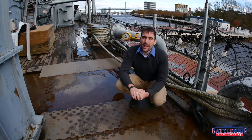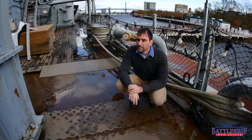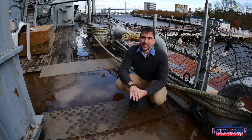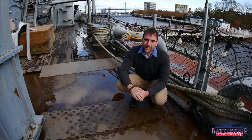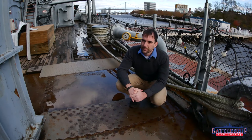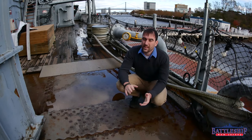Unlike the Liberty ships, which are designed to be mass-producible — they're blocky, they can be built in segments and thrown together really easily, which involves a lot of welding and deleting the riveting entirely — Iowa-class battleships are not built to be prefabbable. As a capital ship, the U.S. Navy chose to expend a lot of resources building unique pieces that would have to be basically hand-pieced together at the Navy yards. That's probably part of the reason why two of the six Iowa-class battleships were never completed, because it is so difficult to slap them together as opposed to mass-producing some of these smaller, quote-unquote war-built ships. The nice thing about gold-plated ships — the term for interwar ships not built with wartime expedient measures — is that they'll last longer. The Navy sure got a long life out of the Iowas.